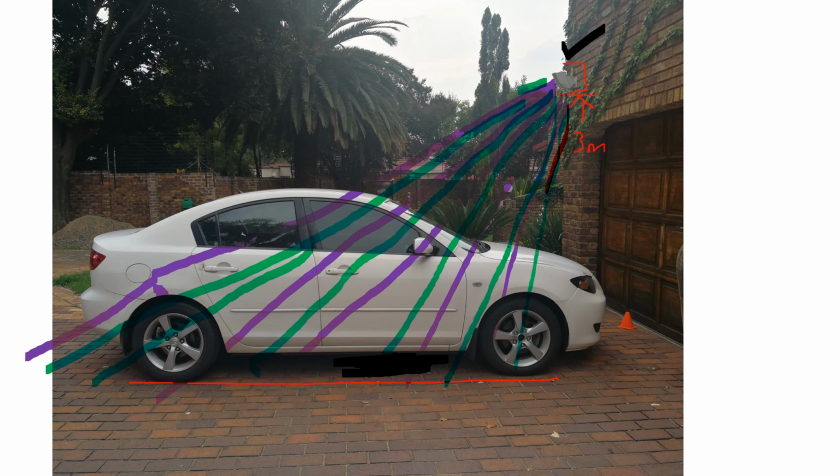But what I want you to see is that if you look at the width here on the ground, maybe it's 40 centimeters. But if you follow this up here to this height, you'll see that to break these detection zones, it's half. So this is one of the reasons why the placement of the sensor is very important, because on the ground, yes, somebody walking would break these quite easily. But when you're looking at an angle, especially at a higher plane, the width between the zones of detection is actually reduced.